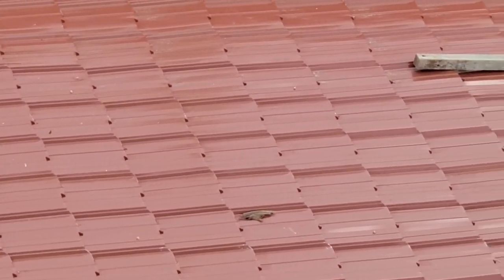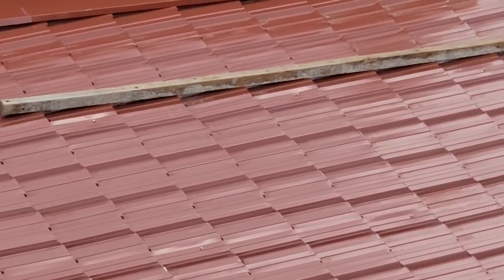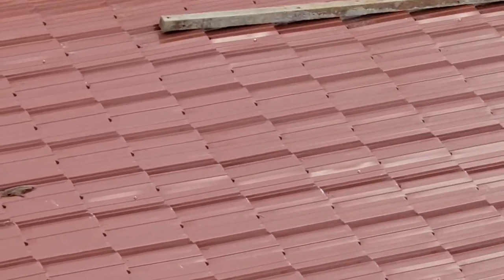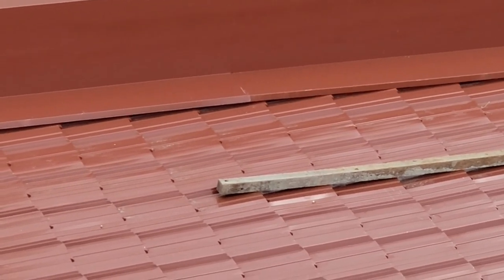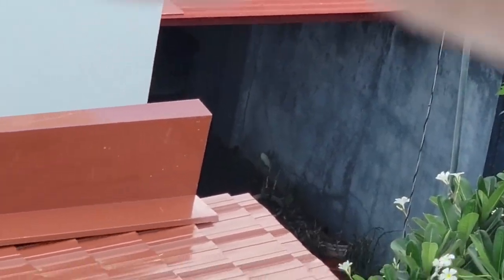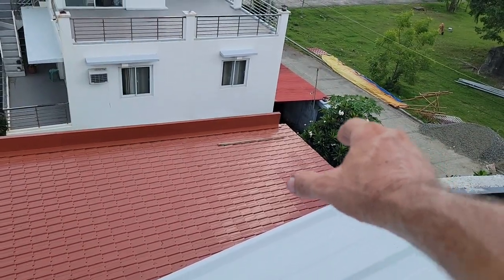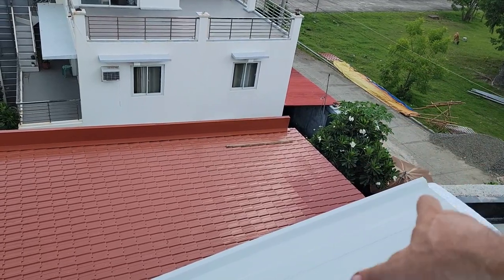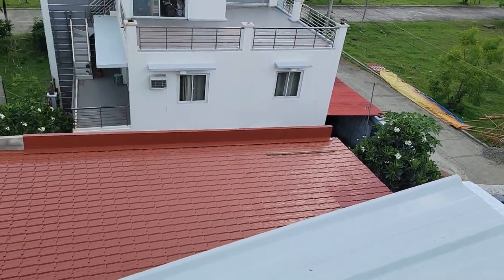And then it terminated out on the last purlin down there. It terminated out sitting on the high part fold in the metal, and it kicked the end of the roof up. So the whole end down there, let me back this camera up. That whole end right there, like where you see that shadow and all, is flared up. And when it's raining, it pulls water up in there.